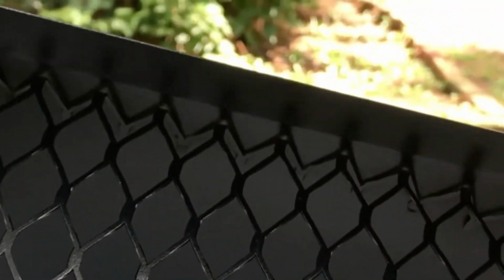There's not much you can do to keep insects out while keeping your fireplace fire worthy and fire safe. The screen is just too fine. You can't ever use that. California uses a 5/8 inch gap. This is a standard industry 3/4 inch gap. So this is fine. I'm gonna go ahead and get up onto the roof with it and show you how the attachment is.